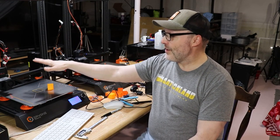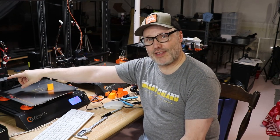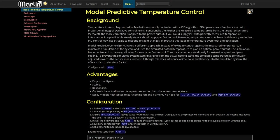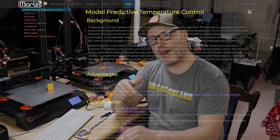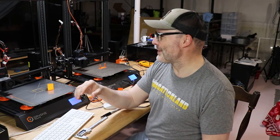With this machine done, we went through and made a lot of changes to the firmware. This one has the original E3D V6 hotend — that's what the DDS ships with. One of the things in the firmware is we're not using PID auto-tune; we're using MPC — it's a different way of maintaining hotend temperature that takes into consideration the wattage and heat retention. It runs a self-test and tells you the values to enter. He also offered suggestions on how the BL Touch works — rather than the probe going up and down every time, it does the whole G29 mesh process a lot faster. Linear Advance has also been enabled. This machine has a lot of potential.